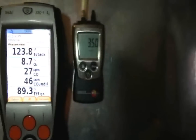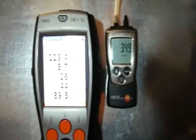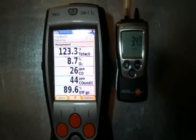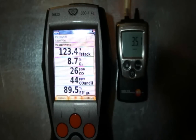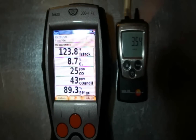We're running again with fuel pressure sitting right at 3.5 inches of water column and starting to settle out on the analyzer. We know we're still a little bit under fire based on clocking the meter and our known input from the supplier. I'm going to let this stabilize and then adjust the fuel pressure up — I'm going to take it up to about 3.7 inches of water column since we're not far under fire but we are a little bit.